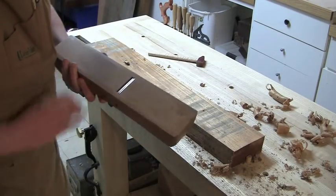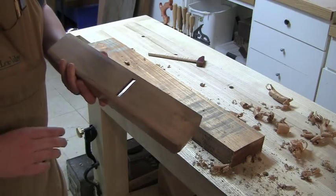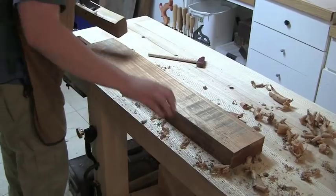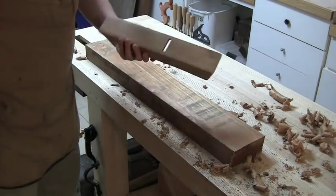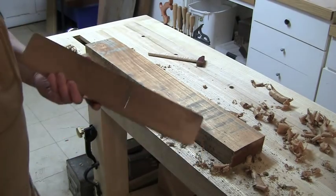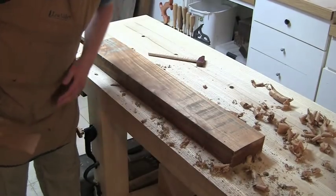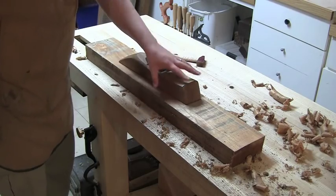A tight mouth is a very good thing — let me be clear about that. You can't put wood back on, so Scott has made it so this works very much like a good jack plane. This board is not ridiculously out of flat, but it's had lots of time to weather in sun and rain, so there's definitely some unevenness. Relatively quickly, I removed most of that gray. I have the flexibility to use a file to remove a little wood and make it a more aggressive plane, or leave it as is since this is difficult wood with lots of switchback end grain — and I don't have any tear-out on this face.